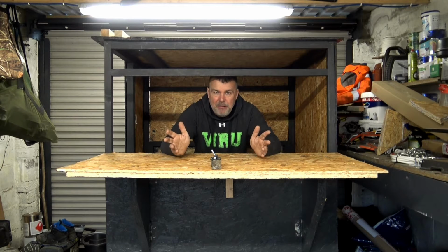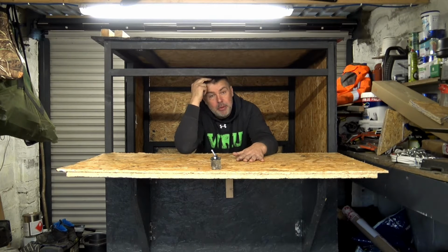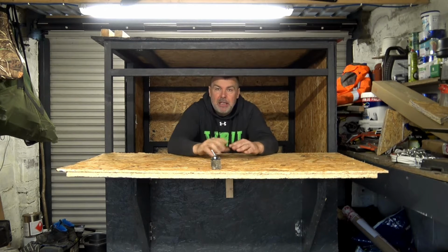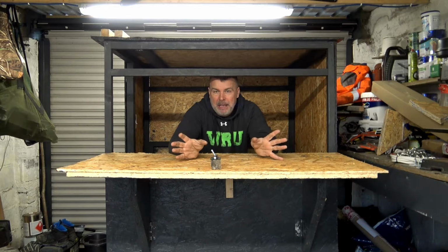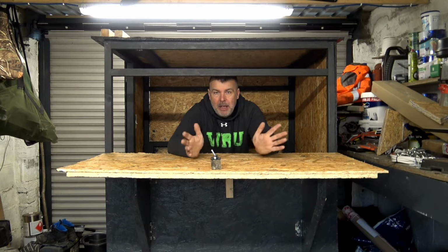It's pretty self-explanatory. It's a 12 volt heater system. It's a 5 kilowatt heater. It's powered by diesel and it's got its own tank. It's plug and play basically. You put it in, you cut the hole out for the exhaust and the air intake, and then you fit the heater. Connect it all up, there's a little control panel, there's a little remote control with it. Connect up the diesel, put a battery to it, and away you go.